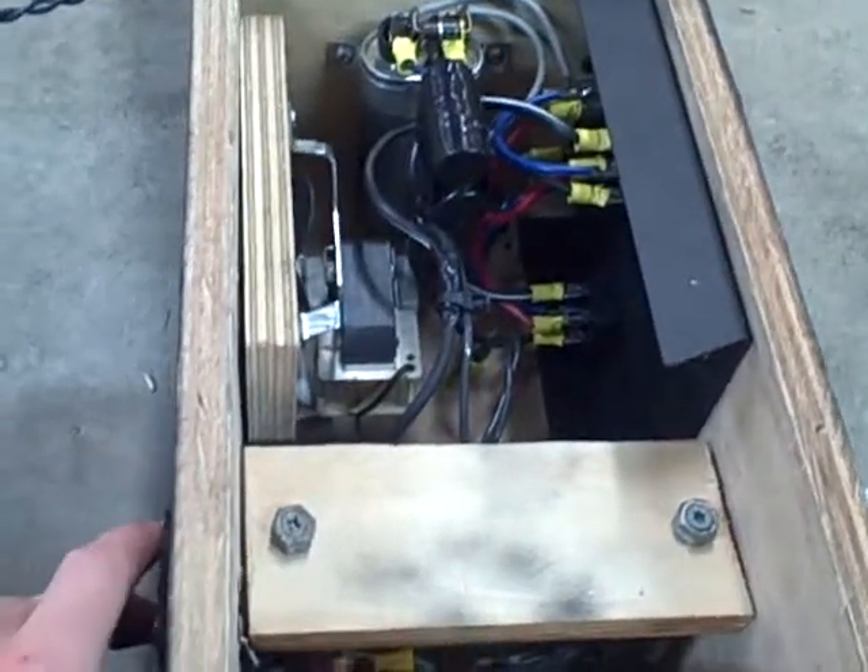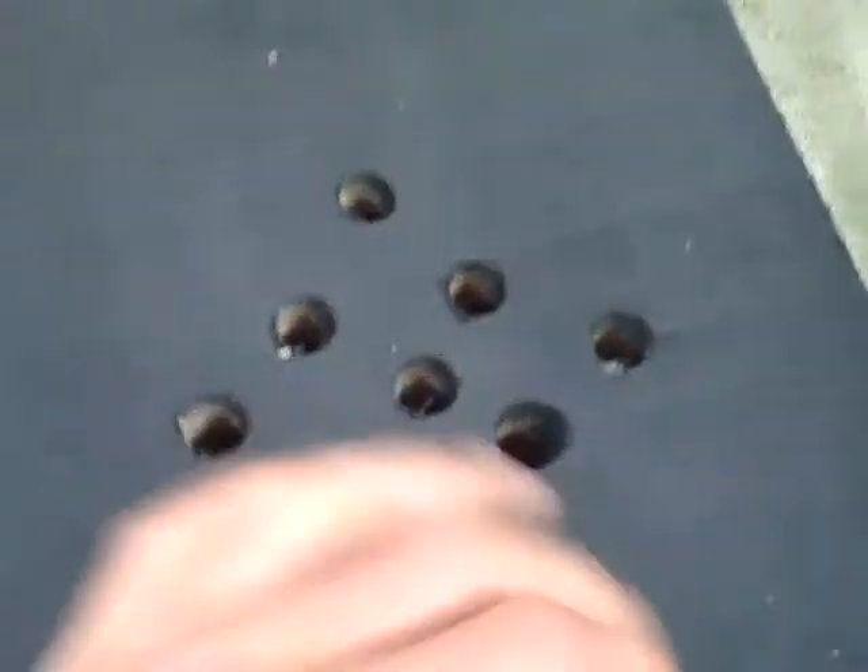There's also a bleeder resistor — I'm not sure it's necessary at 20 volts but I put it on there anyway. When I first started running it, it had issues getting too hot. I added a fan — actually out of the same microwave — and when you plug it in the fan powers up and blows air out through a grill.